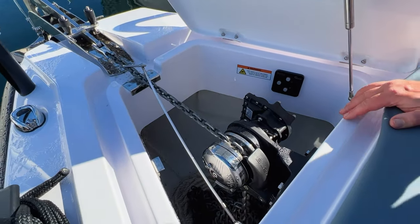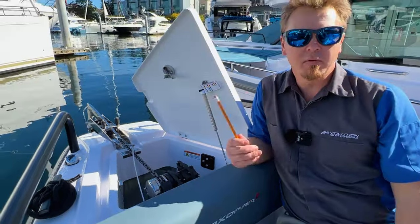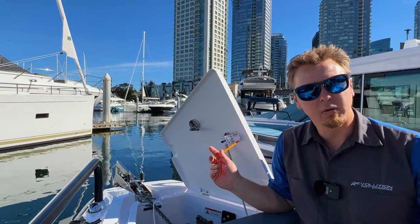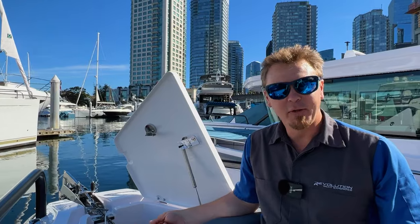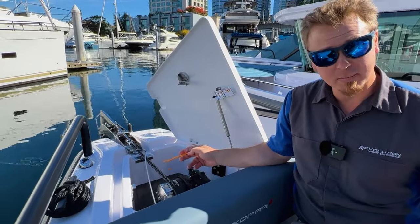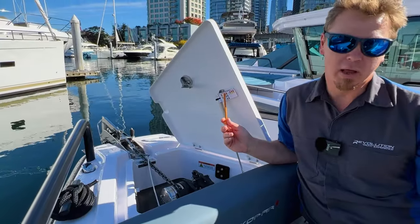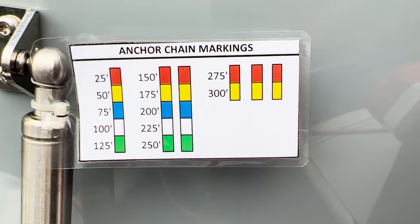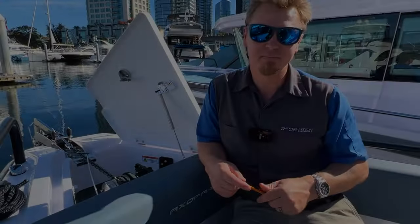Now the anchoring event is over. I'll take a moment to talk about this little chart here — not every boat will have this, but if you buy one through Freedom Marine with Revolution commissioning it, we typically put these anchoring legends on. Each color represents a zap strap on the anchor chain: every 25 feet there will be a color. For example, one red zap strap equals 25 feet; two yellow zap straps equals 175 feet. There's another legend inside as well.